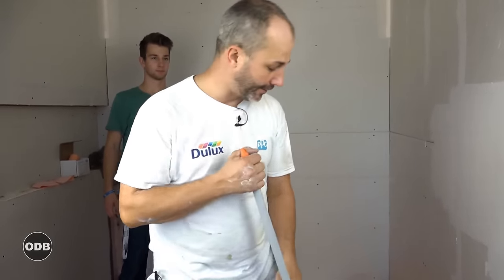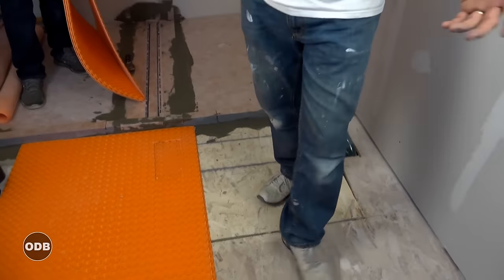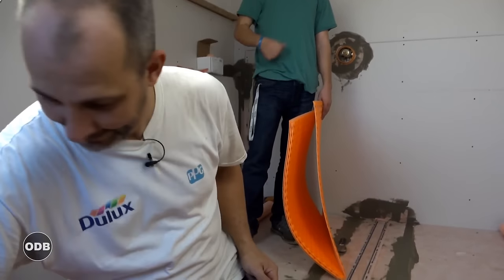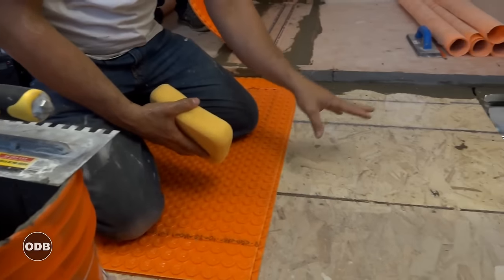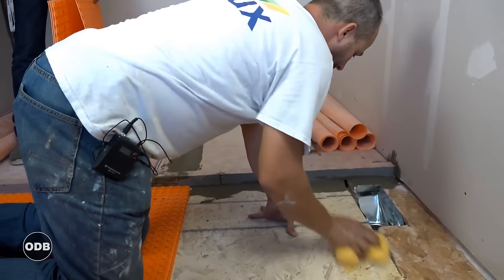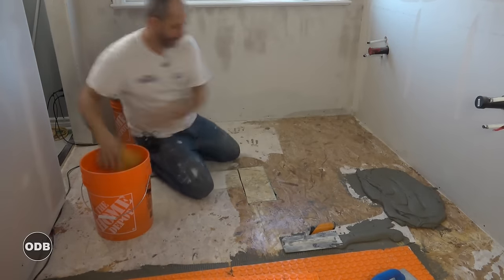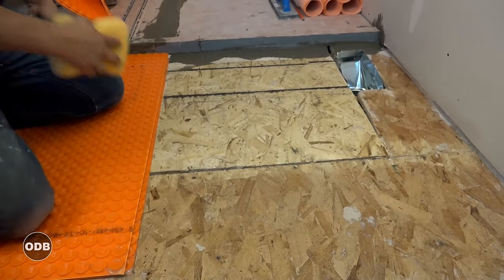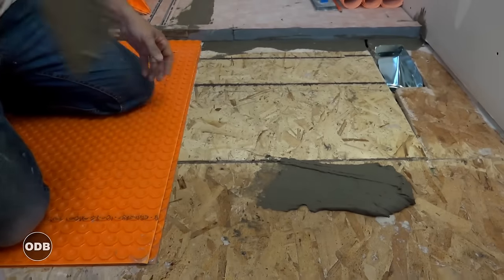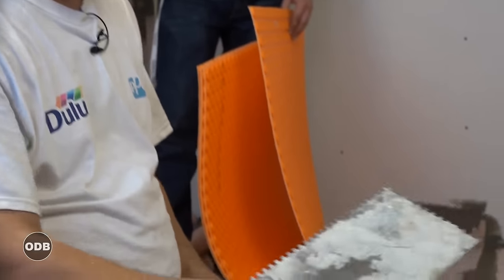This is an uncoupling membrane with a heating system installed. We just have to make sure we're nice and clean — no debris, no screws being tracked in from other parts of the job site. Unlike most things, the instructions say clean and dry, but here we want clean and wet — very important. You can install this membrane right over top of the subfloor. This house has three-quarter inch construction, so it's incredibly strong. We wet the wood because wetting your substrate creates a better bond.